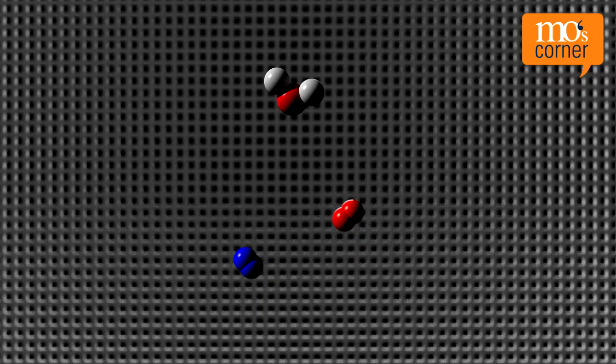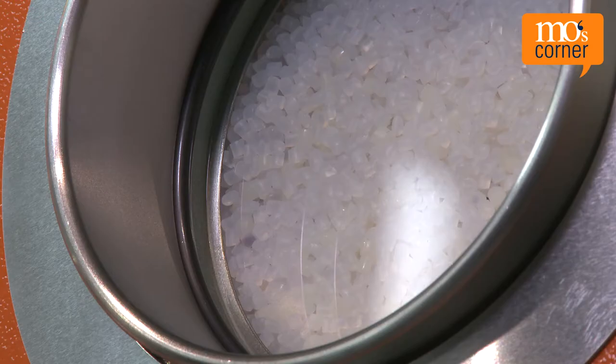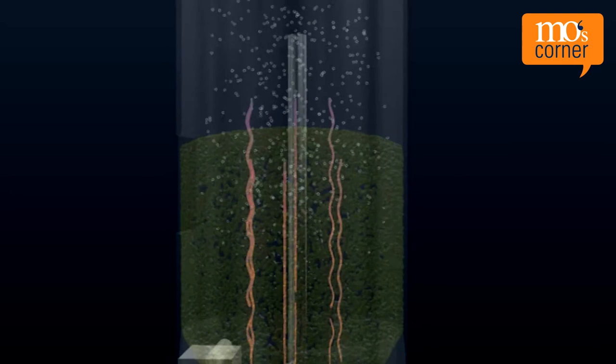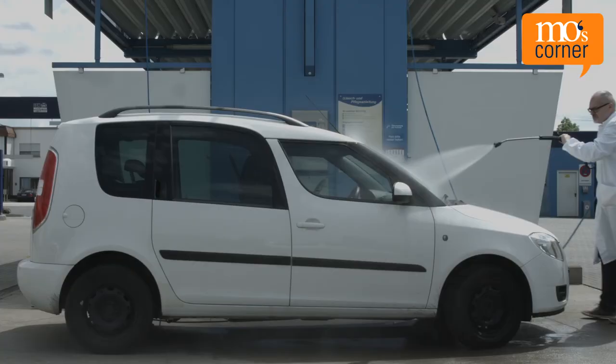You can picture a molecular sieve more or less like this: nitrogen and oxygen can filter through, but not water. The material is filled into the drying bin from the top and removed at the bottom for further processing — it's dried passing through top to bottom. However, material can only be removed at a pace that allows for the necessary time of exposure inside the drying bin.